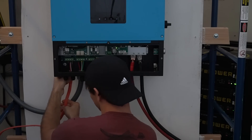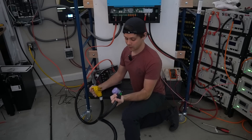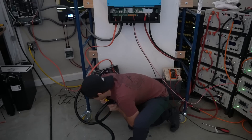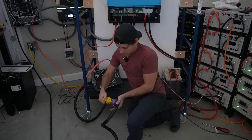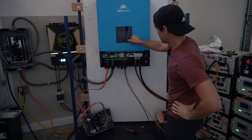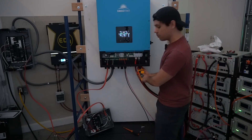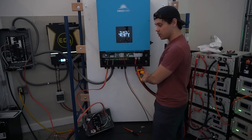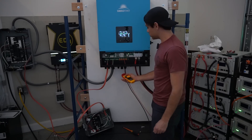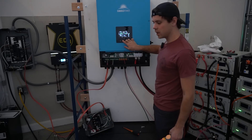Gotta be very careful. This always scares me. By the way, this is not live — I like to plug these in first then turn it on at the breaker box; it's just safer that way. Look at all that exposed conductor — you could easily kill yourself. Now we have power. I think it bypassed. We need a meter — we're only pulling 5 amps; previously it was like 100 or 120. So it's powering the car charger off of the AC input and we're still charging with solar. We're pulling 24 amps from the grid. Let's change it to the other off-grid mode.